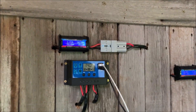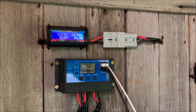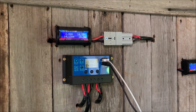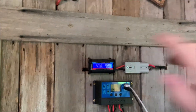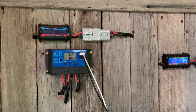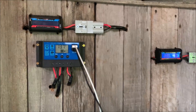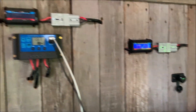My biggest issue with this controller is you don't really know what it's doing — whether it's in bulk charge mode or float mode, where in the charge cycle it is, or how full the battery actually is. So I'll isolate the panel, pull this one out, and replace it with the Victron MPPT. I'm going to have to do something about my USB connectors because I won't have that on the Victron — oh, got one there, another one down below, so should be all right.